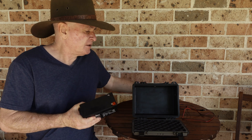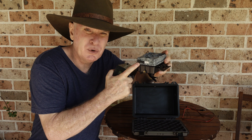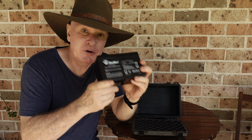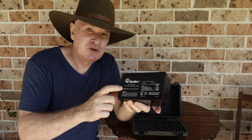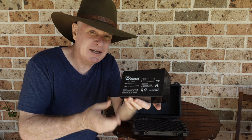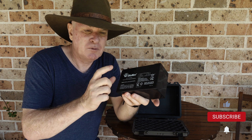Keep in mind, some trail cameras run different voltages — it's up to you to determine what the voltage input is. Some are running 6, some are running 12, I don't know if others are running 9s. So I determined I need a 12 volt battery, which I've got. This is 6.5 amp hour — that was the closest I could get to the 7 amp hours that the manufacturers are putting in their kits. These can go upwards with different types of amp hours, and it's basically how long the battery is going to last.